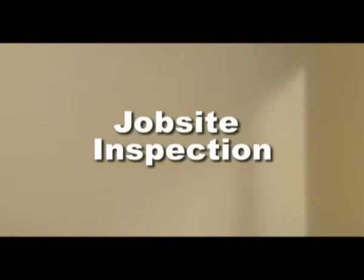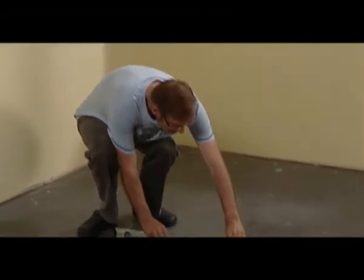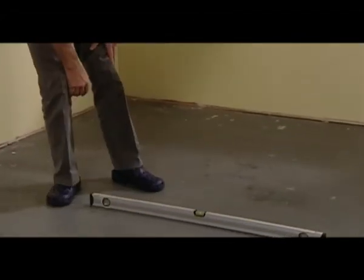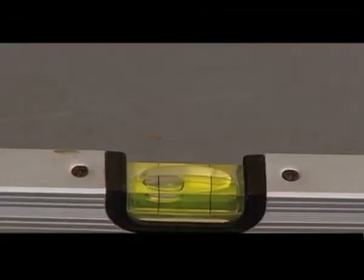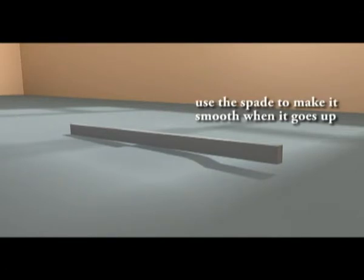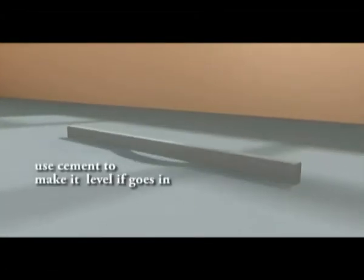Job site inspection. We should inspect the room before installation. Firstly, the concrete floor needs to be smooth, clean, thoroughly dry, and with no possibility of leaking water. And the uneven difference should be less than 2 mm. If not, use the spade to make it smooth when it goes up, or use cement to make it level